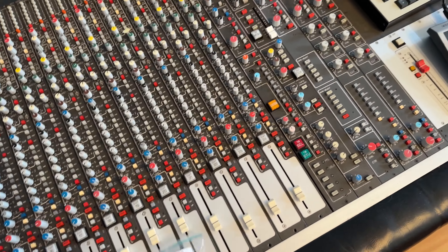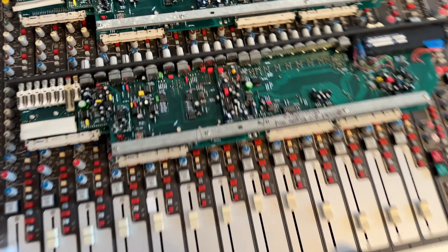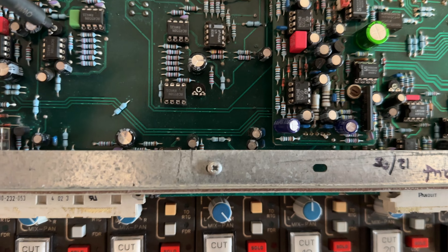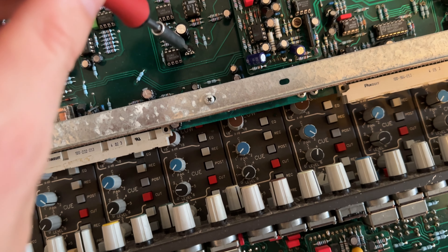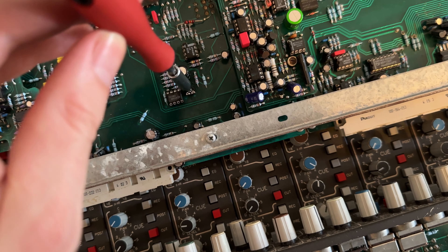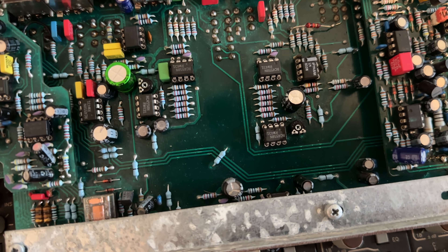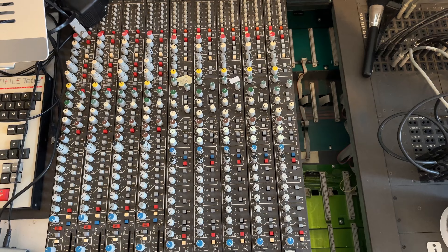I mean, in the end, this is just literally the same pot. These actually feel a bit scratchy when you turn them - right here doesn't go smooth all the way. So with these two, I tried to add some of the DeoxIT. Now if I turn them, they go a lot smoother without any crackling resistance that I can feel. So maybe before I go at it and exchange everything, I will take this bucket and apply the DeoxIT.